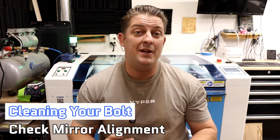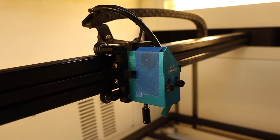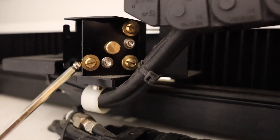Let's check our mirror alignment. Misaligned mirrors can cause uneven engravings and hurt your cutting power. Luckily, the Bolt Pro 32 makes this process extremely easy and it only takes a few minutes. I'm checking alignment using the tape method — basically, I'm jogging my machine around the perimeter of the bed and firing low-powered pulses. This leaves marks on the tape and tells me if the laser beam is firing in the correct location. In my case, everything is properly aligned and no adjustments are needed. I've had this laser for about six months and have never had to adjust the mirrors — they were perfect right from the factory. But if the laser beam isn't perfectly centered, just use the adjustment screws to fine-tune the laser position. This step might take a little patience, but it's worth it for optimal performance.